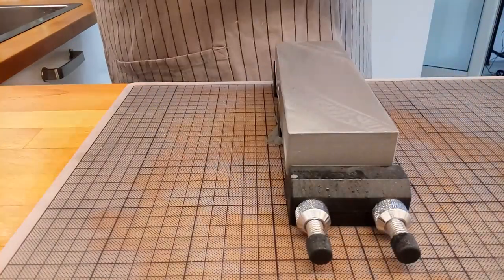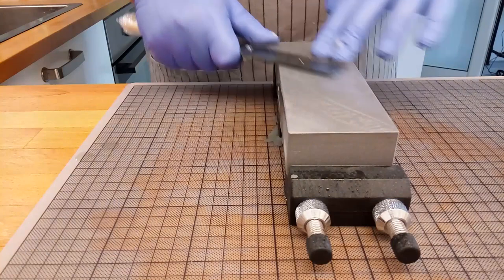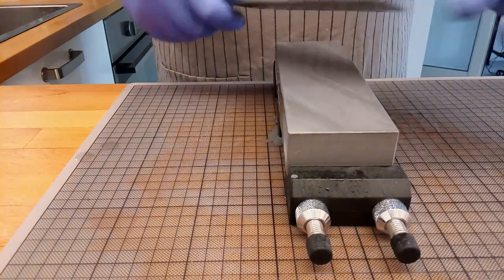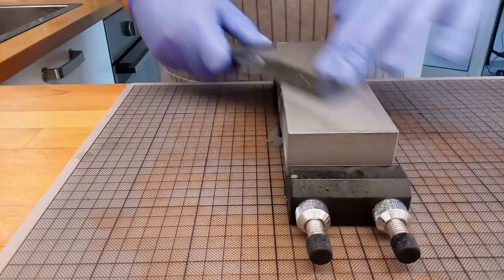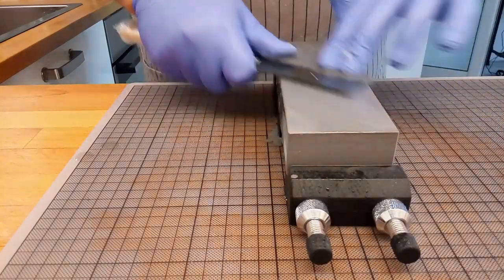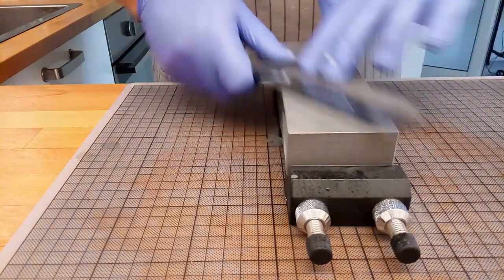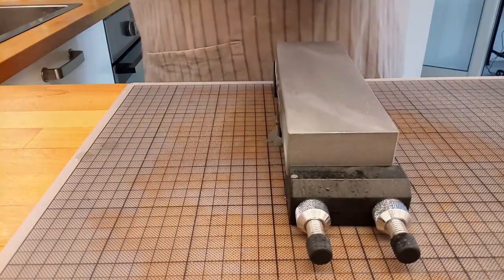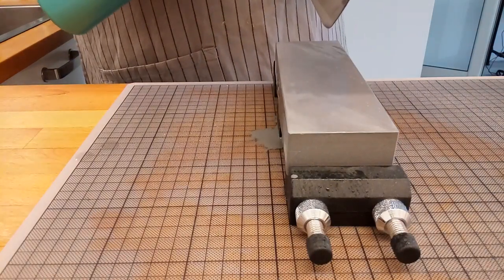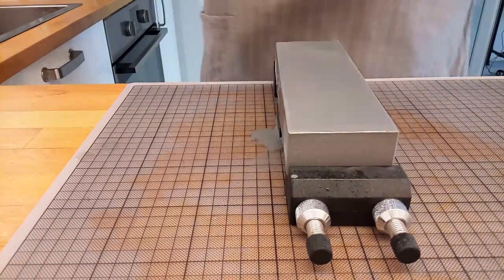After all, I think some kind of slight convex will be created, but I'm trying not to exaggerate the curve. The blade is pretty stiff, so you can do long sweeps. I don't think it will change something. Plenty of mud. To wash it onto the stone.